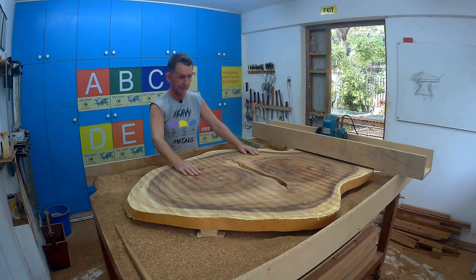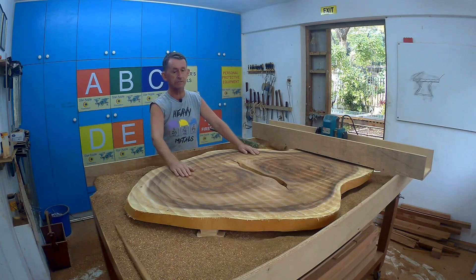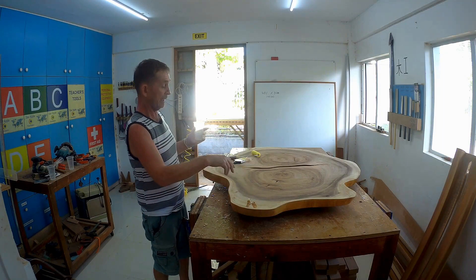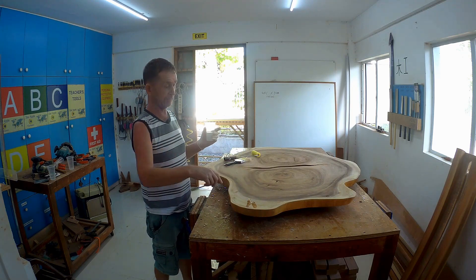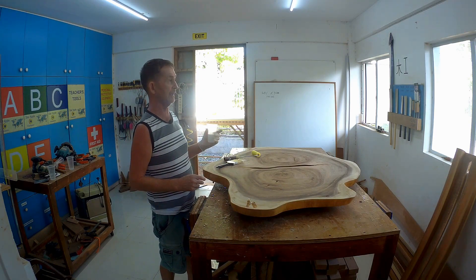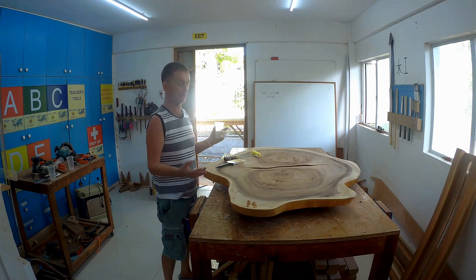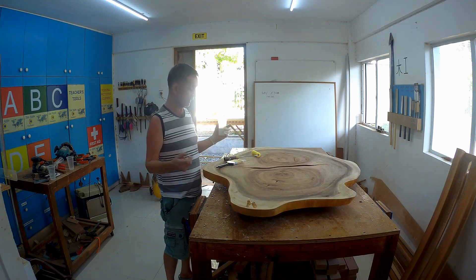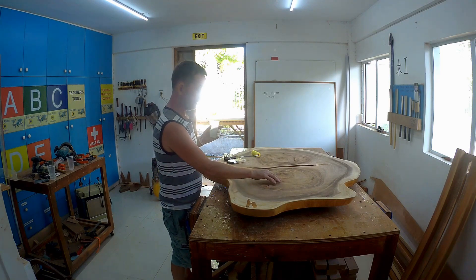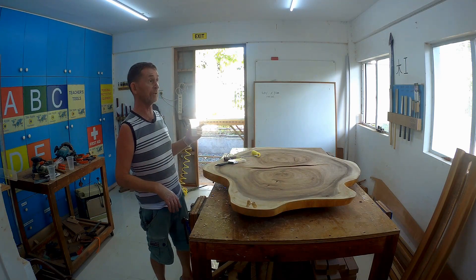Okay, this is the top - I'm happy with this now. We'll take all the varnish off the sides as well. We've sanded both sides and done a better job on this side. I'm sealing it using a self-levelling epoxy - it's different than laminating epoxy. I'm going to give it a sealing coat first, and then when the table is all made up I'll level it and put on a thick final coat. After the sealing coat dries, these little shakes can be filled and we'll give it a light sanding before the final coat.